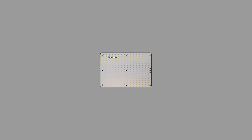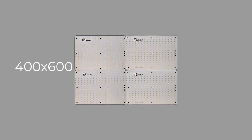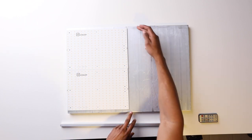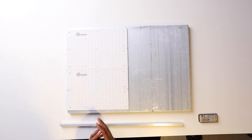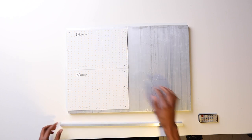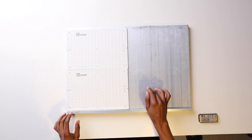This is the point where you set the dimensions or configuration of your panel. With this setup you can choose either an 800 by 300 mm or a 600 by 400 mm fixture — the latter being what I chose. I joined two heat sinks together; each is 300 mm wide with a custom length of 430 mm. The LED panels are 200 mm wide, making 400 mm when joined, and that extra 30 mm gives 15 mm each side to accommodate the mounting brace or box section used to join them.